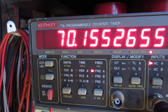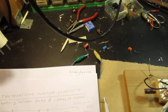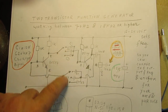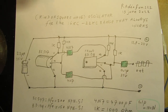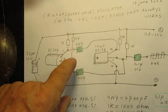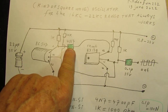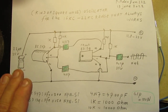Anyway, I don't want to get into more complicated discussions. So here the circuit again from a certain distance. I hope you can read it properly. Of course, this capacitor sets the frequency, and this is that first circuit where it was all derived from. Now we have here a switch that switches in different capacitors, C1, C2, etc. And in fact, it's completely the same circuit.